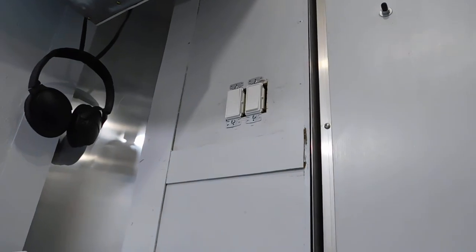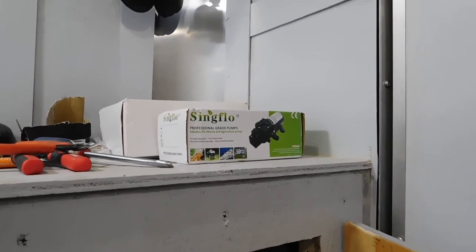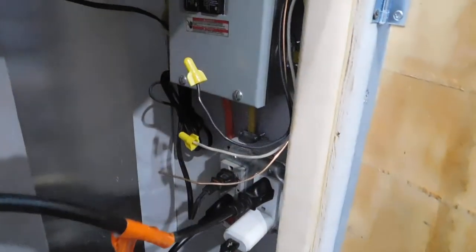Under here is my electrical panel — it's got a magnet on it too. As you can see, it's pretty roughed in right now. The wire with the wire nuts is for the far back switch, which is going to control my water pump and instant water heater, if I decide to put one in. For now it's just going to be a switched receptacle.